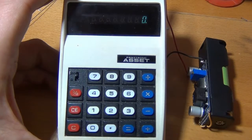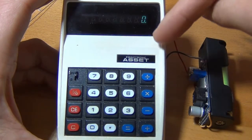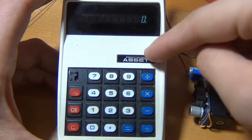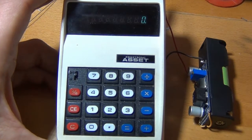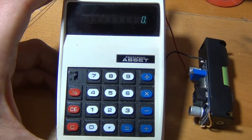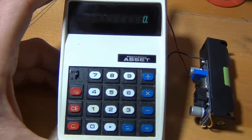For the screen, I read about it — it's a vacuum screen, so it uses some higher voltage. So there should be some kind of DC-to-DC converter inside. Let's open it up and see what's inside.